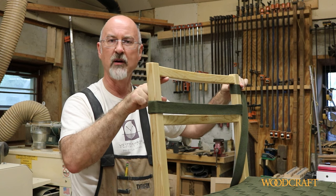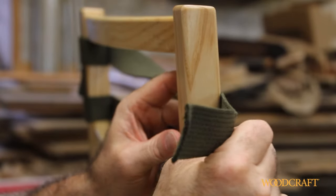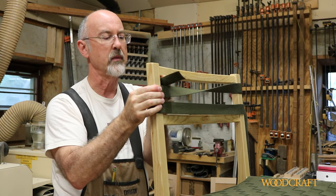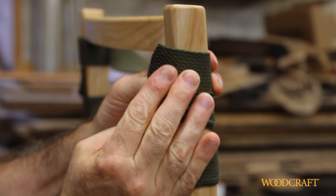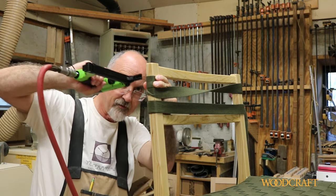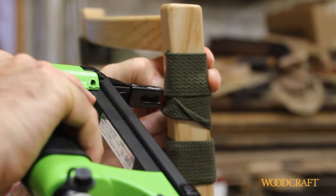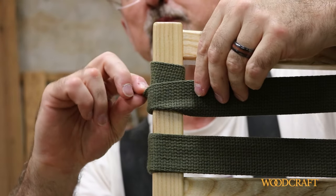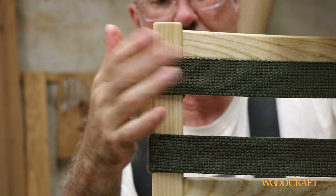For the second piece — the one at the top of the back — it's going to come across, and I'm going to put that twist in so it twists down and then twists back up, so that I can cover up the staples. Here at the back side of the leg I put my little fold in, pinching it to hold it tight, fire a staple in here, making sure it's lined up with the bottom of the top rail. Then I flip the twist out of it and work this one up to cover up the staples on the back.